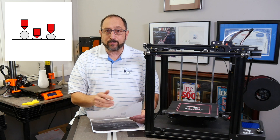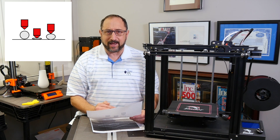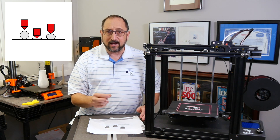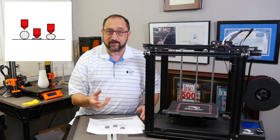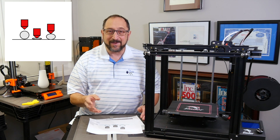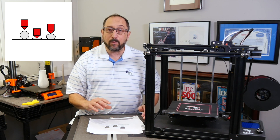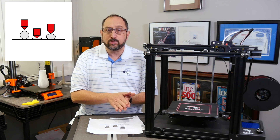In the center example, the print head is too close to the print bed — if you get really too close, you'll damage your print head. In that case, the bead is very flat and your first layer will seem very, very thin, which will also not be very effective. The third one is just right, as they say in the Three Little Bears — a print bead that's slightly squashed. It will stick to the print bed and yet maintain its volume because it's not pushed too low.